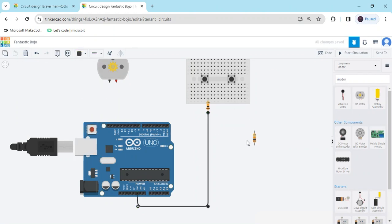I have another resistor connected to the second push button, and the second terminal of that resistor also connects to ground. Now the digital pin connects at the point of the resistor which is connected to terminal 2A. I have connected digital pin 4 to the first push button on the same line as the resistor.